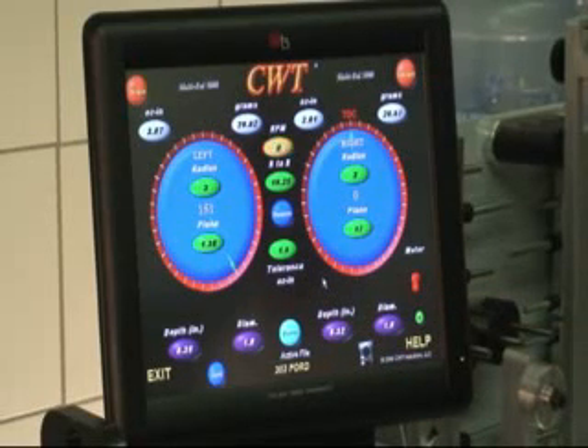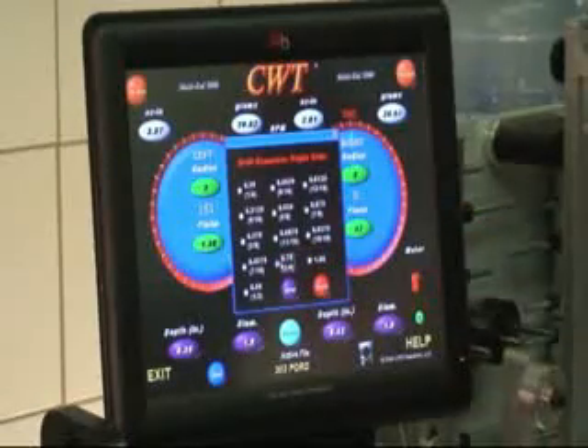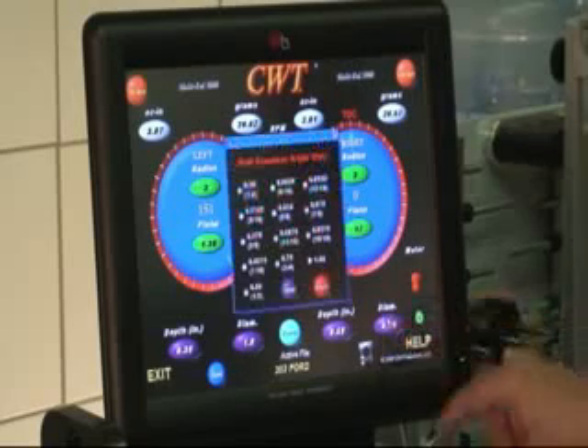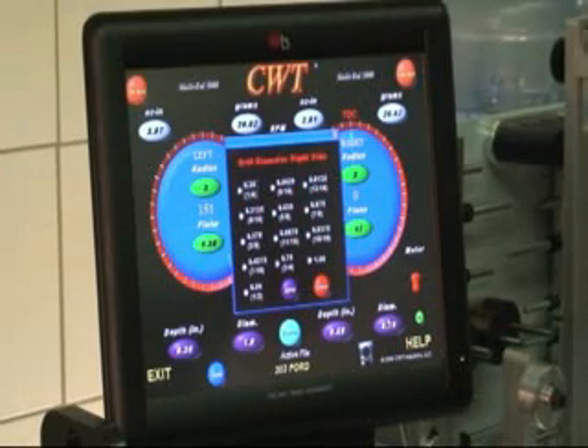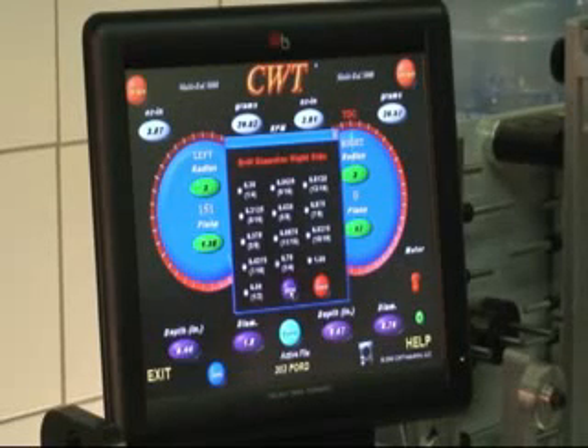With the other side, you're going to see 0.32 — that's 320 thousandths. One thing you want to pay attention to is that we can select any drill size we want. For instance, let's assume the counterweight is set up so that instead of being one and a quarter wide, it's only one inch — we couldn't use a one-inch drill. So I'm going to select three-quarter, and you'll see that the assigned depth has changed to 0.59. Now, if it's a virgin hole — in other words, there's no hole at all, so there's no lead point — we can actually activate DPC. That stands for drill point compensation. The depth has changed from 0.59 to 0.67, compensating for the lead of the drill. To turn it off, you merely touch it again and it's back to 0.59. It's important you understand this because you only get one time at this hole — you can't use DPC in a hole that's already drilled.